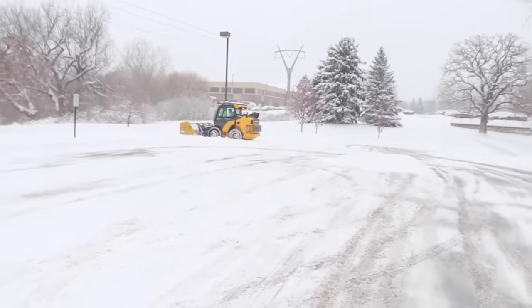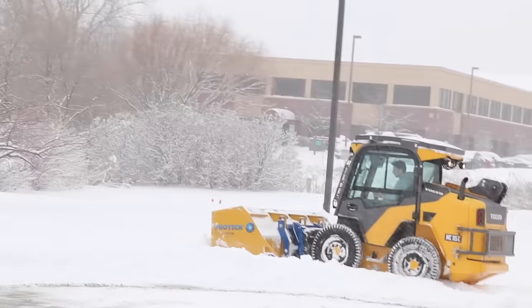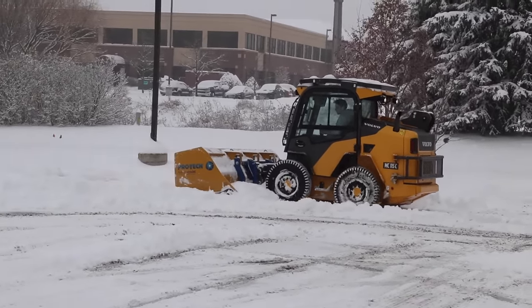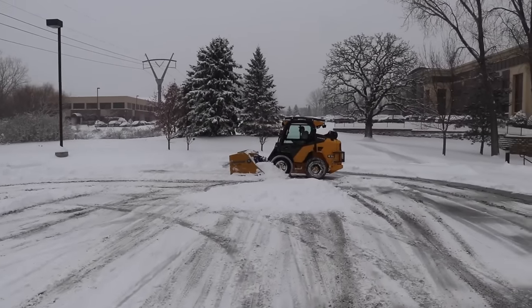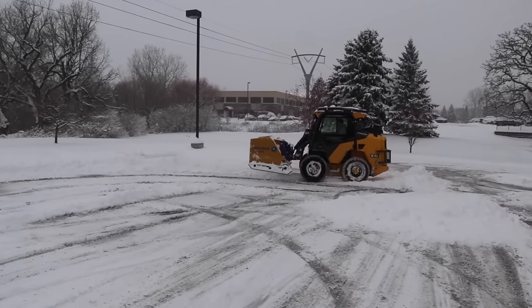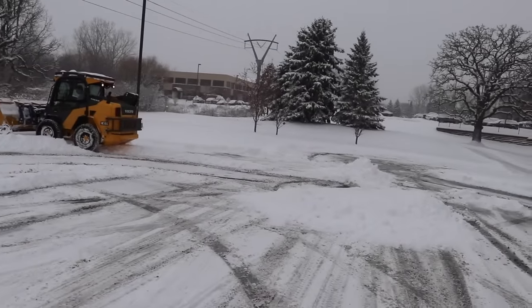With a static pusher, you do have to apply down pressure, but you gotta get it just right. With one of these floating pushers, it's not as critical because the weight of the pusher itself does the work for you. What's really important is to keep all four tires on the ground at all times. When you keep all four tires on the ground, you're gonna have the absolute best traction possible. Way better traction than you are if you're going to be working with a snow bucket or another unit where you see guys that push way down.